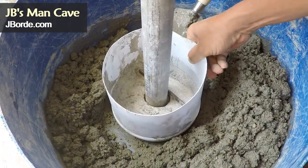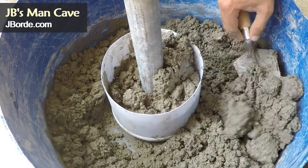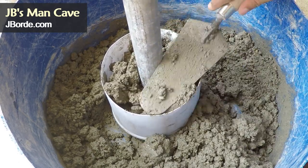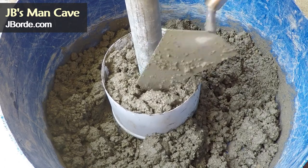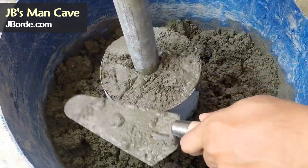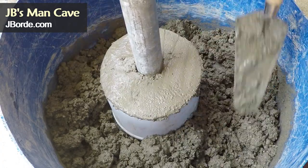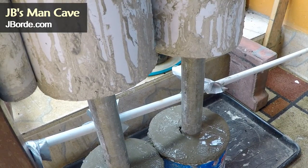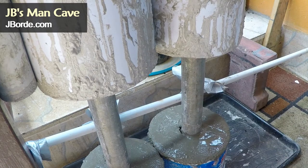In the heavy weights video I used a swivel I made, but in this video I don't need to do that because we're not mixing as much cement. You'll notice there's some metal in it — I add metal as I'm doing that. The metal helps give it strength; that's another thing people may not necessarily do, but you do want metal around it to strengthen it. As you put the cement mix in, make sure to pack it well because it will prevent air bubbles.